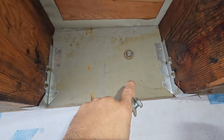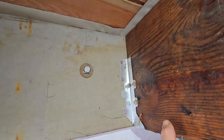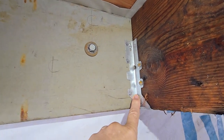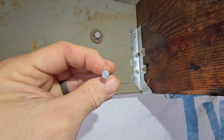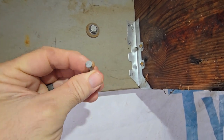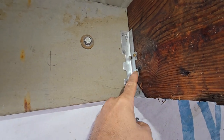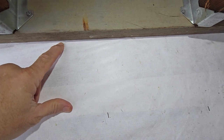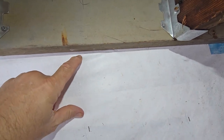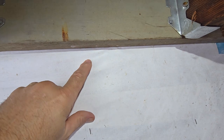3/8 inch lag bolt with a nice solid washer on there. Made sure I got that sucker drilled all the way in. These are 2x6 hangers and this is a 2x10 — I know you guys are going to leave a comment about that. This is going to be enough support, but the most critical part of this install is making sure that you use number 10 galvanized hanger nails. That's critical because you don't want these nails rusting out. Then you just toenail these things in. The last piece of critical information is making sure that you've got vapor barrier between your shear wall or siding and your ledger — you don't want moisture getting between these two and rotting them out. If any moisture does get in here, you want it to not pass this vapor barrier into your house.